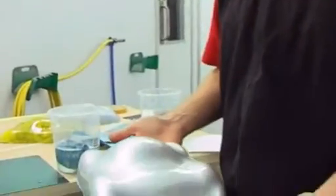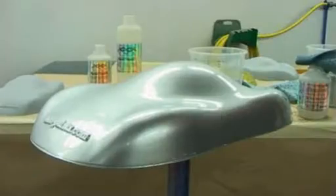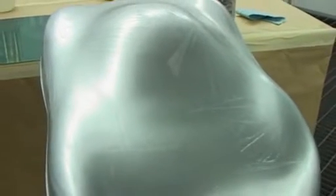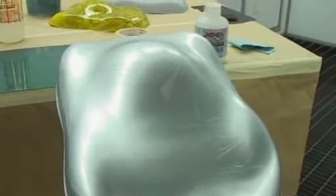Once you've applied it, the solvents and the water are going to evaporate and form a crystal surface. The breaks in the surface are where your contrasting colour is going to stick. For the best effect, don't have the booth running because it'll evaporate a lot quicker and form smaller crystals. It should take around 10 to 15 minutes for the crystals to form.